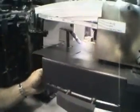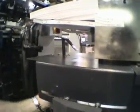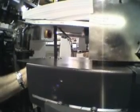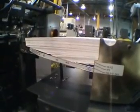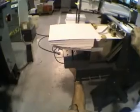This is our large envelope support. What this does is it helps take the valley out of the envelope by pushing up from underneath with its spring pin, and will allow the envelope to take the valley out of the center of the envelope. All this does is act like a support. You're not using it to raise or lower the envelopes. It's there to support the center of a large envelope.